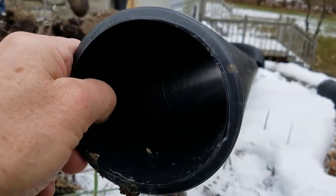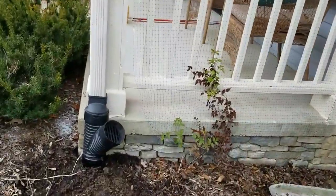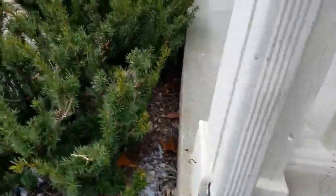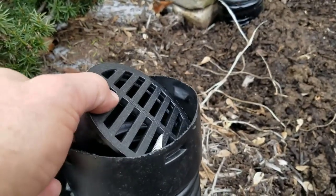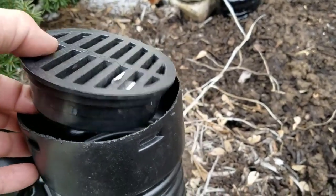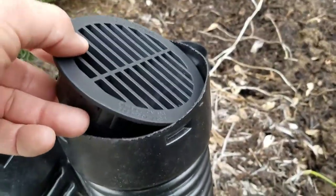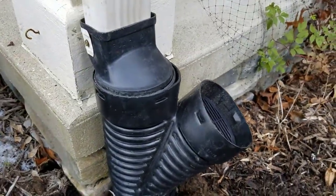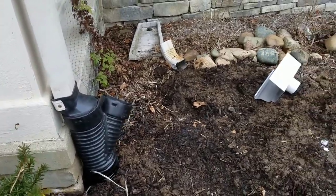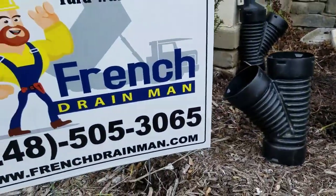Corrugated on the outside, smooth on the inside — this is dual-wall. Combined with the venting, and when you vent this, the NDS fittings fit in these Ys, and that's what we're using. For a Schedule 40 system, PVC Schedule 40 — like an industrial system — I'll use the NDS; yes, they do fit better. But for a corrugated Y, I like the Polylock. The Polylock snaps in here and fits really, really nice. That is a great way to vent a downspout system and combine downspouts to move the amount of water necessary to prevent it from backing up at the roof and pouring over, causing all kinds of damage.